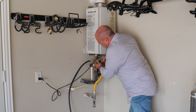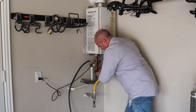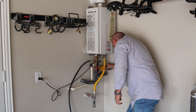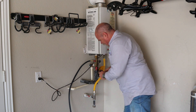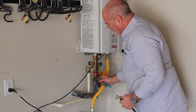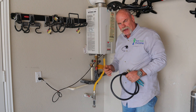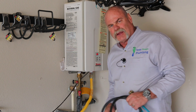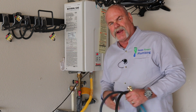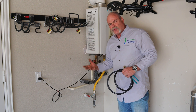Now we've got everything flushed real good. We're going to close the control valve and turn the water back on to the house. Now everything's set and that's really all there is to it. Some water heater manufacturers will tell you to turn the power off to the unit — I actually had one tell me that if you leave it on, where it heats up as it goes through, it'll help clean it better. One thing to remember: you want to be very careful. This is a tankless water heater — it heats water very rapidly and the water coming out of there will get very high. Make sure you're very careful when you spray it into the bucket and rinse everything out. Also remember this water has chemical in it, so make sure you're protecting yourself and doing everything you can not to get any water on you.